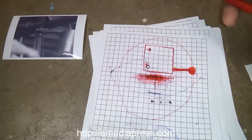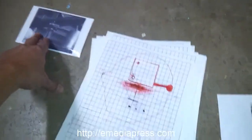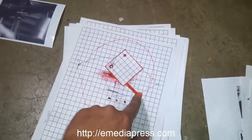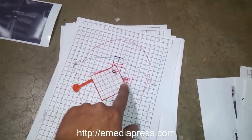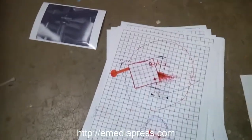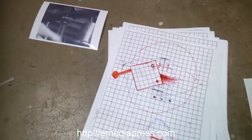So between learning how this is constantly falling in relationship to this upper bracket, and how this orbit moves in an elliptical orbit, because the center through which this weight is rotating around is constantly moving, which also means the center is constantly moving for the bottom shaft too, so you get the elliptical orbit. So anyway, that's really everything about what the Skinner mechanism is.